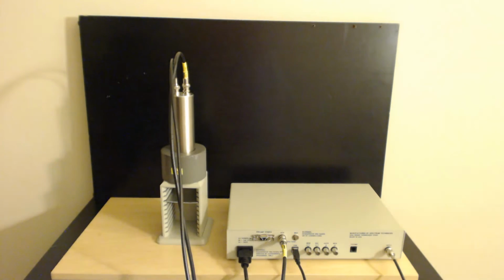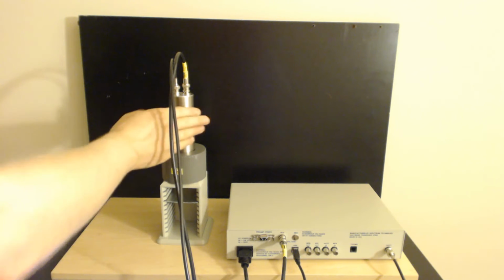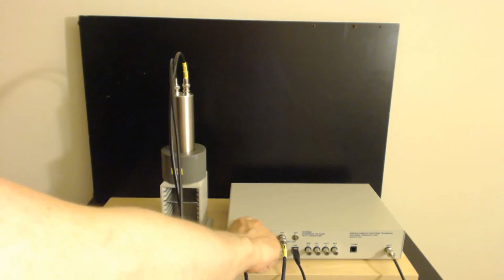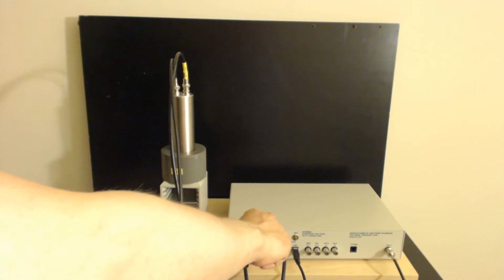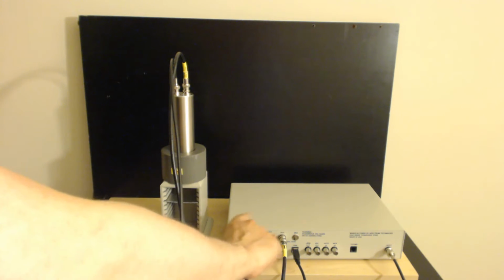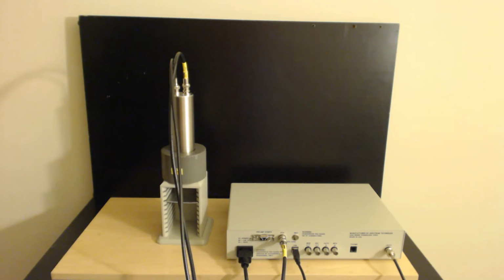You can buy these all the way up to 4,096. You notice these are powers of 2. But anyhow, I got the 1,024 because that's all I need for this detector right here, and I don't have any other type of detector to connect into this. This guy has a pretty fast clock. It's 80 megahertz. It's capable of taking pulses in the 1 microsecond range, so you can get a pretty hot source in front of this thing and not really miss too much.